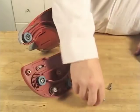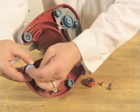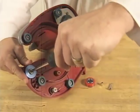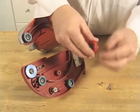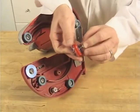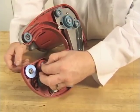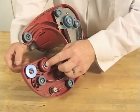Now let's reinstall the groove grommet. To install the outside groove grommet, place it over the boss and slide the Phillips head screw through it. Start by finger tightening it, then snug the screw down to keep the grommet in place. Then take your inside groove grommet assembly, slide the brass spacer in small side first, flip it around and insert the Phillips head screw through the entire assembly. Find the floating nut inside of the saw and hand tighten. Leave this grommet hand tight so that you can move it out of your way when reinstalling the blade. Because of the double-sealed, stainless steel, self-lubricated bearings in all of our pulley assemblies, they have an extremely long life and may never need to be replaced.